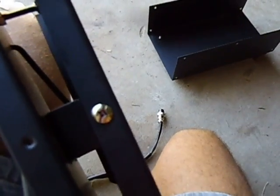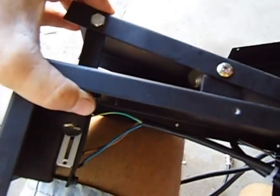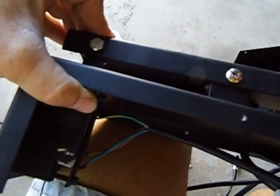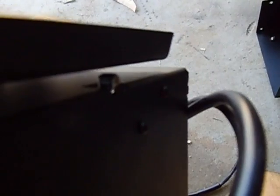When you press the pedal, it actually slides it up and down. It's got a spring in there that returns the pedal back to the top position. So when you push it down, it slides down - as you can see there - and it goes up and down. It should increase the power, and it should decrease it as you come up. The micro switch is just below the pedal, so when you lift up the pedal, there's a little micro switch. When it goes down it touches it, opens up, and breaks the contact of the micro switch.